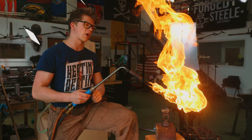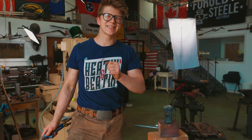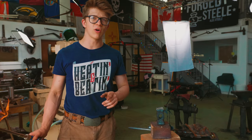Here I'm using 1040 material. You'll remember that one of the steels in the Damascus that we make sounds rather similar — that is 1080. They are both plain carbon steels but not similar in the sense that the steel in the Damascus has 0.8% carbon while this has 0.4% carbon. This means that this will not get as hard, but it also means that it's less liable to crack.